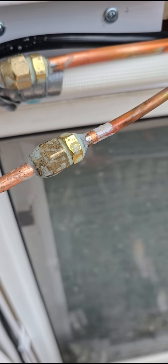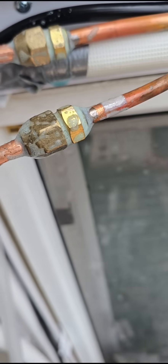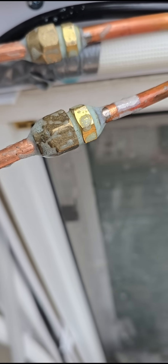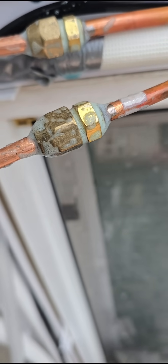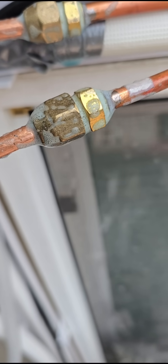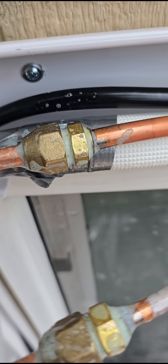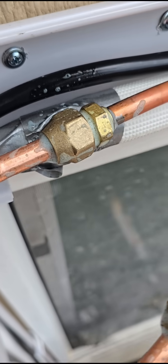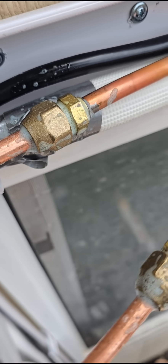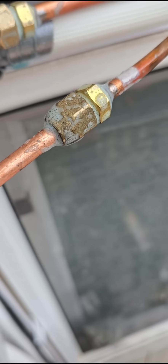I did these about a half hour ago — under 600 pounds of pressure and there's nothing leaking. That's what's nice about the Better Bubble product: it stays right where it's put through the entire testing procedure. If there was any gas trying to escape between those seams, look at that — it's completely covered with suds, so it would bubble up and you'd see it instantly. It totally works, it's fantastic, it stays through the entire time. Anyway, get the Better Bubble — it's the best. We have no leaks.